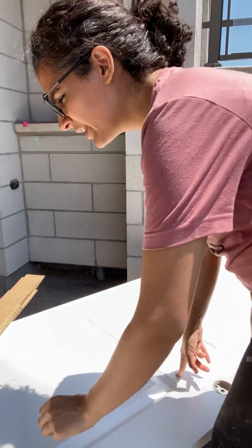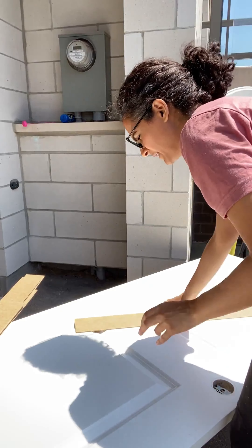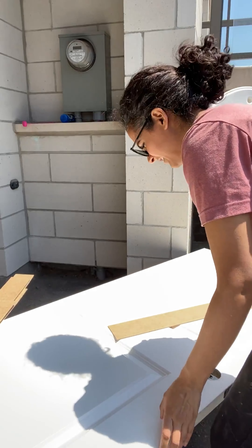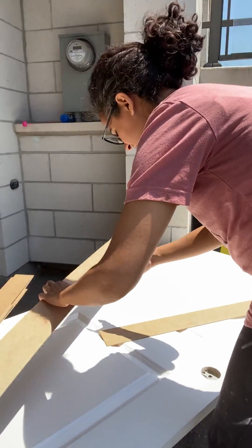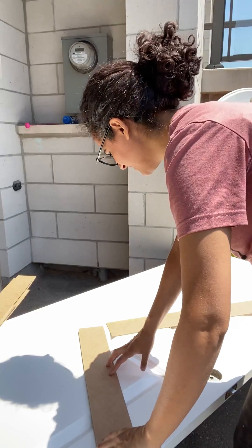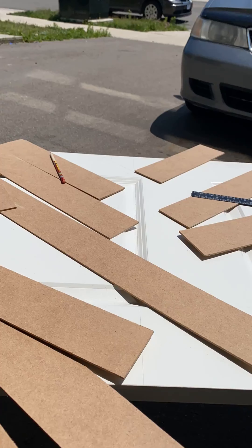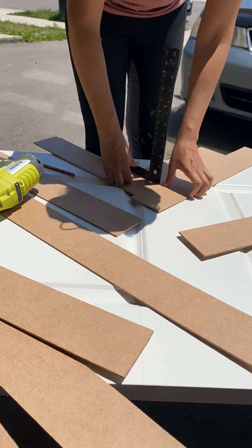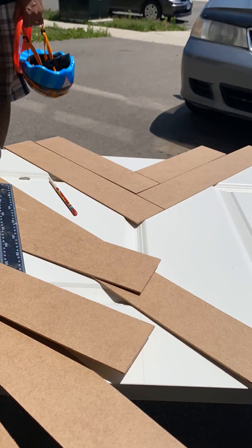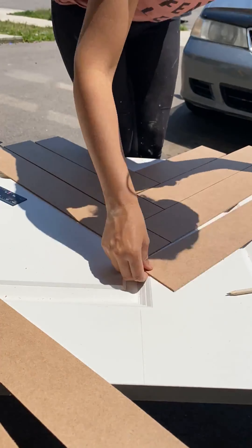So I found the center point of my door, and I'm hoping that I don't have to put a flat panel because all these pieces are going to be put really, really close together. So the design I think I want is going to be something like this. This is already looking so cool. I'm using my pin nailer to nail every single one of these boards in, and I'm using a spacer in between each. This hardboard is perfect for this project because it's lightweight, so it doesn't add a lot of weight to your existing door and doesn't put any stress on the hinges.